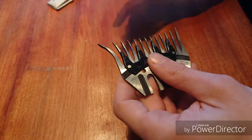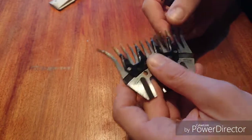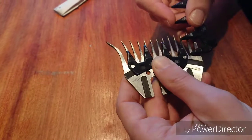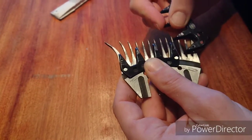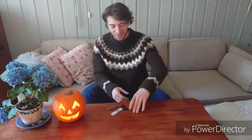My suggestion in that case is: change for a thicker cutter, or move your cutter back so that this little part here is always under the end of your teeth. So there you have it — how to get the best out of your cutters, according to me.